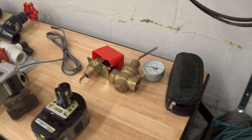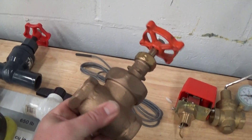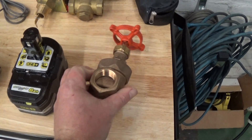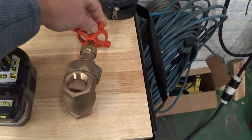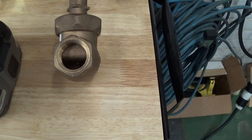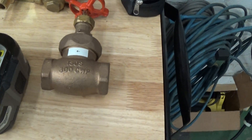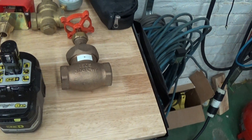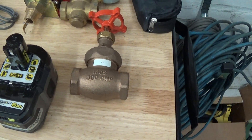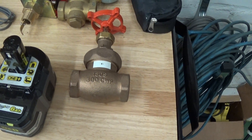Over on our little table here, here's one example of a globe valve. It's kind of a little bit bulbous. When you actually turn the handle, there's a disc that goes up and down and there are some chambers inside, as opposed to just a gate or ball valve. If you google globe valves or ask us, we'll send you some information on them. They're much better and quieter for controlling pressure and GPM.